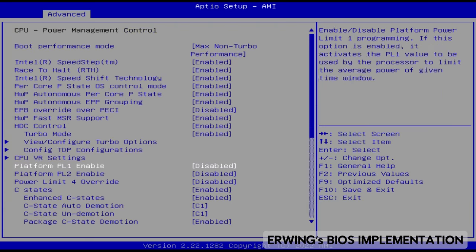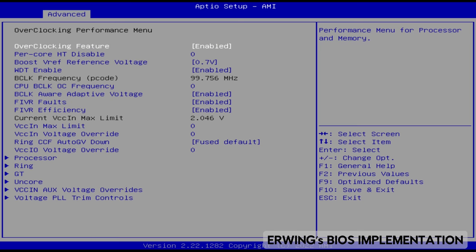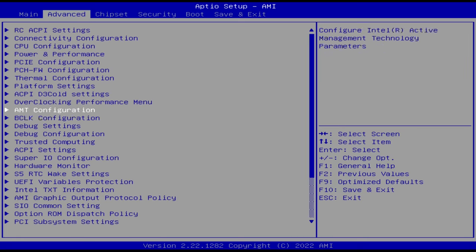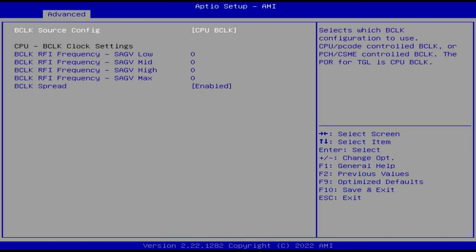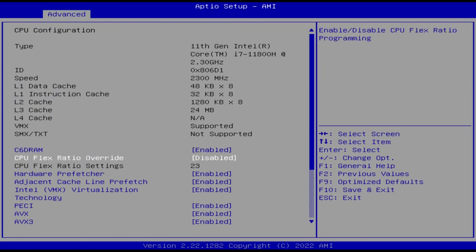So it's giving out pretty decent performance, but keep in mind this is after I tuned the CPU — and tuning did take quite a lot of time. Locking in the memory profiles required going back and forward between different settings, because initially when I tried to configure memory settings it was just spitting out 2400 MHz consistently. I had to set a crucial setting — write protect to false — as well as manually adjust all clock speeds and TDP limits so this thing could boost past 45 watts. Looking at those gaming numbers, if the motherboard wasn't so bad, these numbers would look really good — especially beating the Ryzen 5 5500.